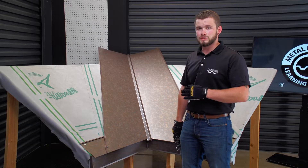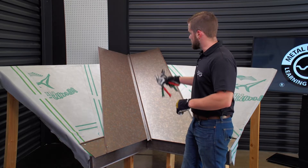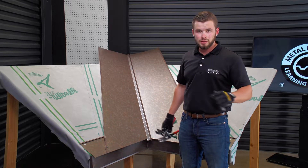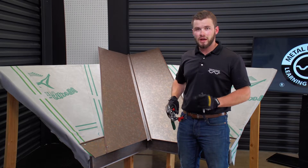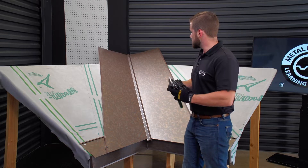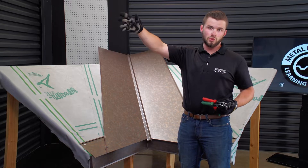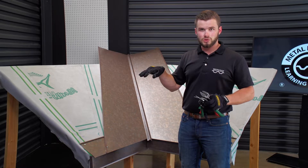Since we're installing this on a single pitch roof, I'm going to go up to the top and trace out everything just like at the bottom. You can leave your two inches up there to close off the top and your top peak trim will come together on the corner. If you're running a valley-to-valley condition — for instance, a dormer — you want to fold the top down over the other valley and run the W of the valley usually close to two feet long. That way when you come in with your next valley pan, you can run those two W's together.